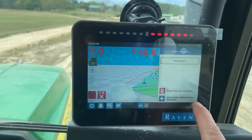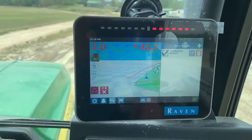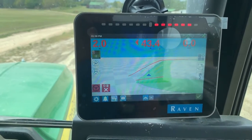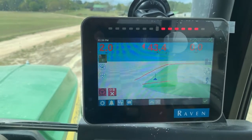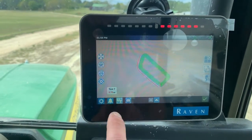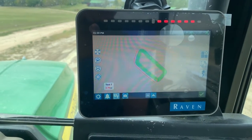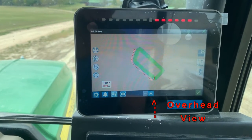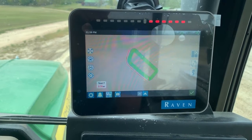So there it's closed in my boundary. I hit the OK button — the green check in the bottom. Then I hit the green check again, the OK button. And now I go to my overhead view. It shows that I have 3.7 acres in this field. So that's a way you determine how many acres are in a field with a field boundary.